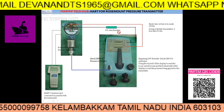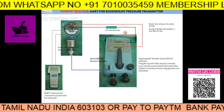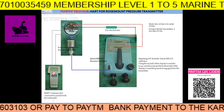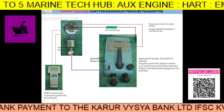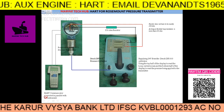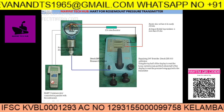Again, you are connecting 250 ohms here. You can supply the current here. Then you have the pressure — this is the pump, and you can pump in the required pressure here. Then you connect the HART — which is the Highway Addressable Remote Transducer — for communication with the instrument.